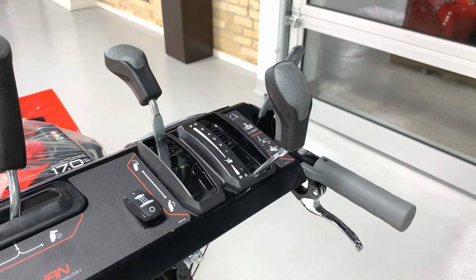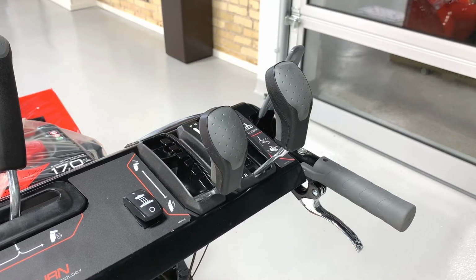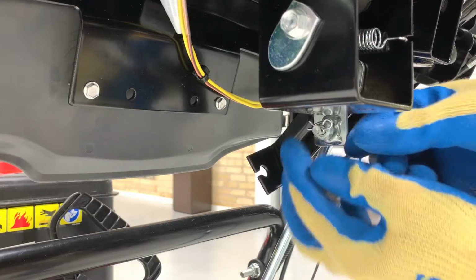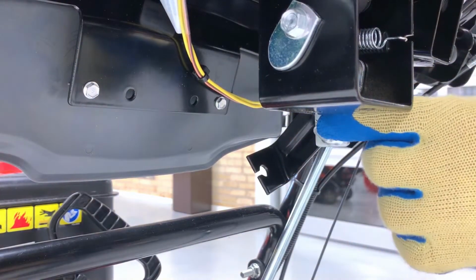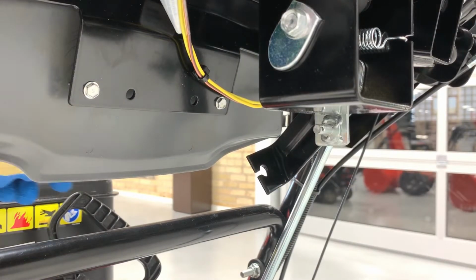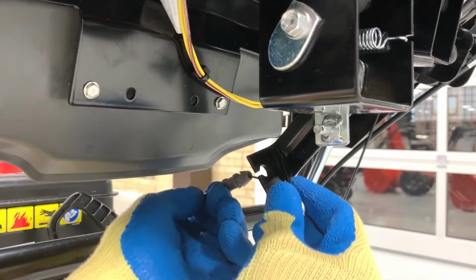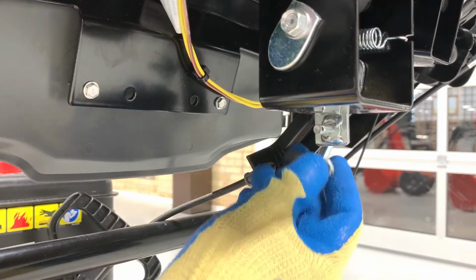Close the clamp with the pliers, but don't close it so tightly that it restricts the cable movement. Move the chute deflector lever to the rearmost detent on the dash panel. Remove the hairpin and the bushing from the deflector lever under the dash. Route the chute cable over the lower handlebars, pull the rubber boot away from the cable anchor, and insert the anchor into the anchor bracket.